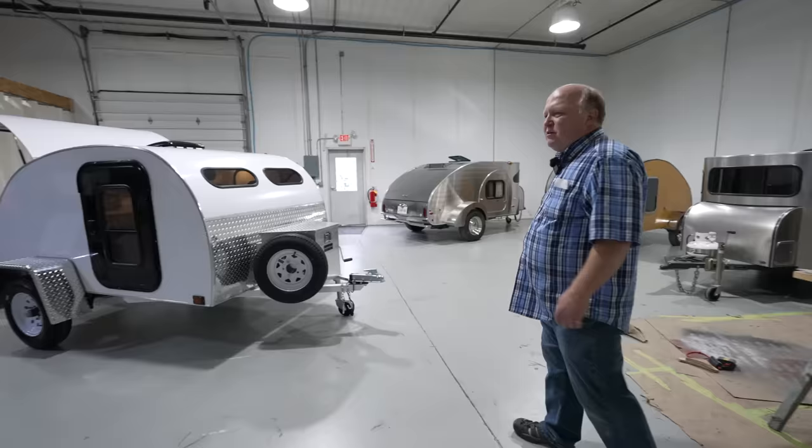But it can't all be roses. Does this trailer have any issues? Here are the three things I would improve if I had the chance. Number one: the hatch latching system. This is a problem I've found plagues probably all composite-built trailers. Even my experience with Bean trailers has led me to believe composite galley doors are just difficult to latch properly. I think this has to do with the lightweight nature of the doors — being half the weight of a typical galley door, they just don't have the oomph to properly close. They do always close, but they take a few seconds to manipulate the position to ensure it latches properly. On the Bean you just have to give it a bump with your hip; on this trailer you can see it just needs a bit of jiggling. Not a big issue, but something I believe they can alleviate if they put their minds to it.